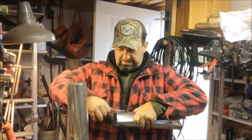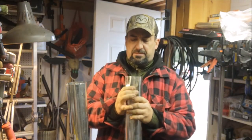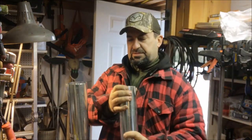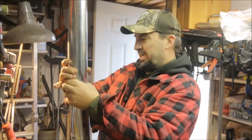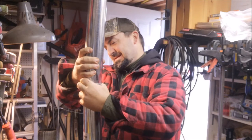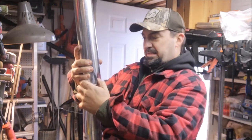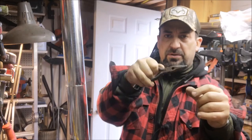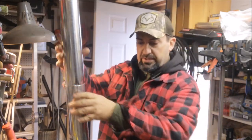You can see it's starting to give that rippled appearance all the way around the inside. In the field I would still have pliers from my multi-tool. It worked — just popped out for a second, catching on some burrs, but there it goes. So with just needle nose pliers or a multi-tool you can give it a quick turn — probably not quite 90 degrees — and that's enough to crimp.